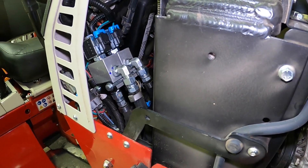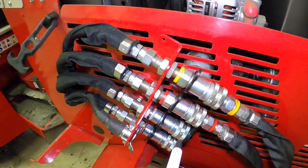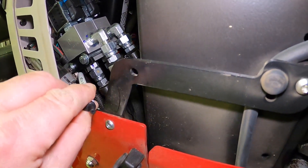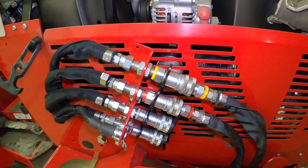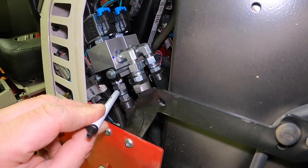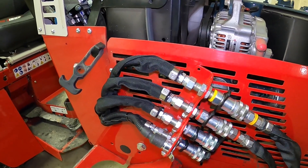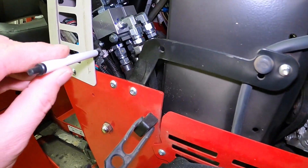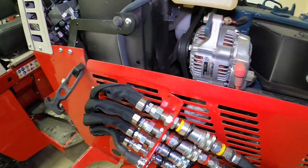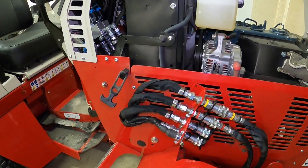Before ending the video, I want to show how this works. Here's the valve assembly I installed. The lines I took off went right in the middle — when you use your auxiliary function normally, the fluid flows by default through there and up through the yellow and red lines, just like factory. By depressing and holding the little green button, it throws these electric actuators and diverts the fluid away from the default path, sending it down to the auxiliary lines instead. For the grapple, you press and hold the green button to operate it; as soon as you let go, it diverts right back. Pretty slick setup.